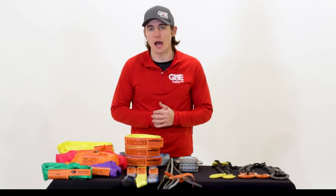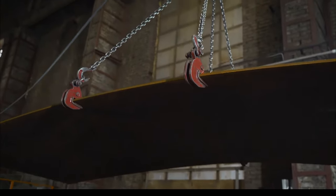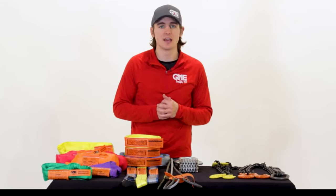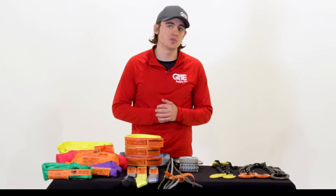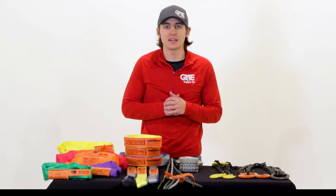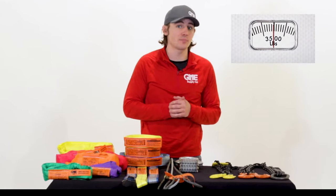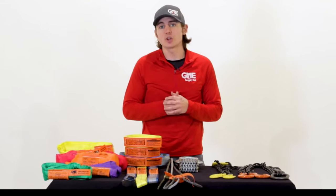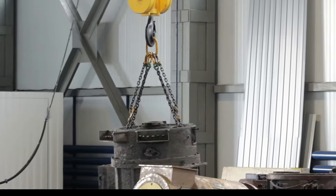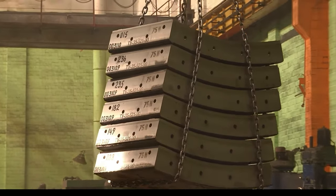Each of these parts has a few different options depending on their intended use. Like wire rope slings, alloy chain slings can have anywhere from one to four sling legs. Alloy chain slings are easy to inspect, can be repaired by replacing individual links or link segments after proof testing, and can be recertified for use in the field. They are also easily adjustable by removing links or link segments. Alloy chain slings can be found in 9/32 of an inch to one and a half inches and have a lifting capacity between 3,500 pounds and over 90 tons. While these slings are perfect for the most intense jobs, they are typically more expensive and have a tendency to damage the load. Alloy chain slings are mainly used when other slings are likely to be damaged, like in foundries, steel mills, and heavy machine shops.